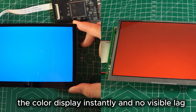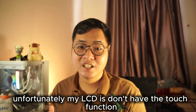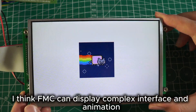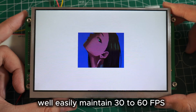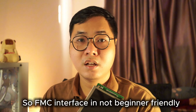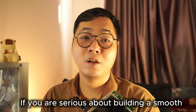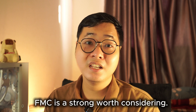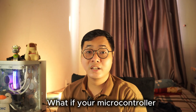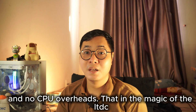The color updates are instant with no visible lag. Unfortunately my LCD doesn't have the TE (tearing effect) pin, so I can't demonstrate perfect sync for you. But at its current speed, FMC can display complex interfaces and animation well, easily maintaining 30–60 fps. FMC is not beginner-friendly, but it can deliver incredible speed. If you're serious about building a smooth user interface, FMC is a strong contender. And there's one more level beyond FMC — where the microcontroller streams video directly into the LCD without any CPU overhead. That is the power of LTDC.